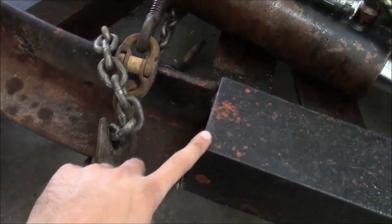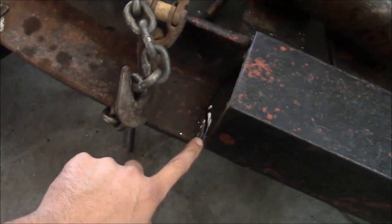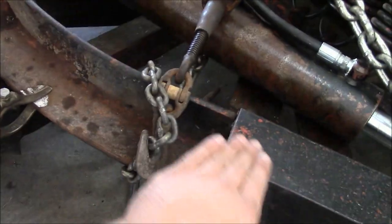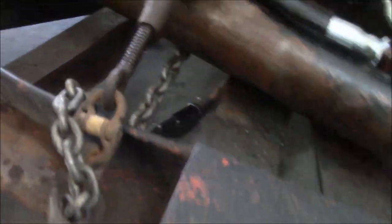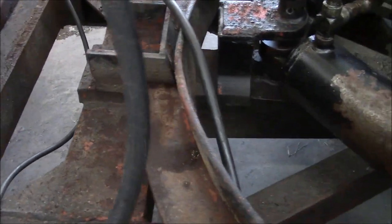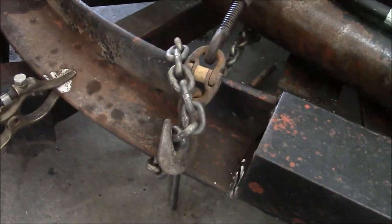This plow frame is actually made of two pieces of angle iron welded together. This one that's broken is a continuous piece — it goes all the way from one end, around the bend, and all the way to the far end. But right here where it's broken, it's pushed out a little bit and it's got kind of a twist going on. What I'm going to try to do is pull it over with the binder and tack it real good on this corner. Then we'll get creative with some jacks and see if we can straighten that out. It's not going to be perfect because the angle iron is bent back beyond 90 degrees and the whole thing is kind of tweaked down.